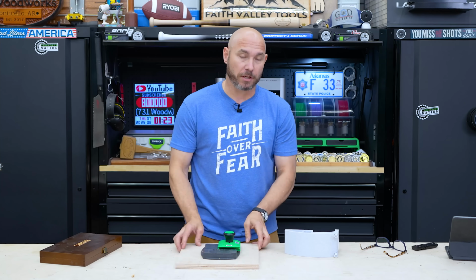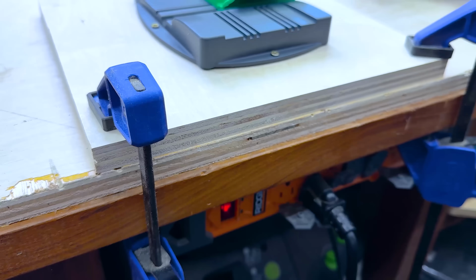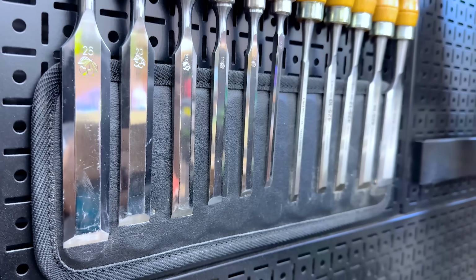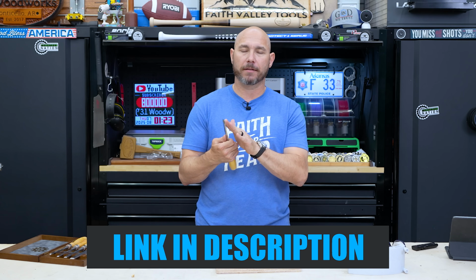Now, how to use this? First and foremost, it comes with diamond stones and this jig. I secured mine to a piece of plywood to make it easier so I could clamp it down. From there, all you have to have is a chisel. You're going to take your chisel out of the box. You want to flatten the back of that. If you don't know how to do that, I'll drop a link in the description below on how to do it. It's very easy to do.